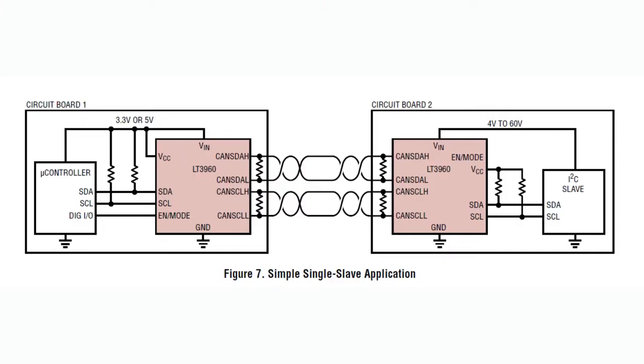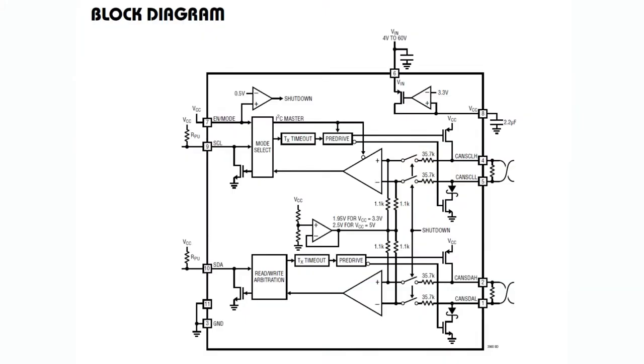So what if you want to have your I2C peripherals far away? That's where this chip comes in. Normally what you would do is get a separate microcontroller, have it on a CAN bus, read the sensor data, and transfer it over CAN bus messages — essentially a CAN bus to I2C conversion. But this chip doesn't turn your I2C device into a CAN bus device. What it does is transmit the clock and data as if it were CAN bus physical-compatible, which allows it to go very far distances.